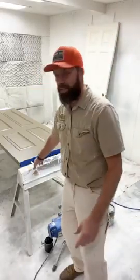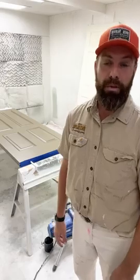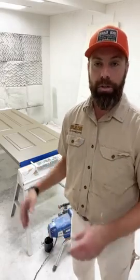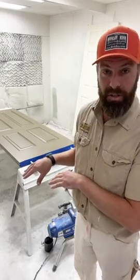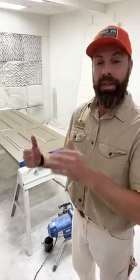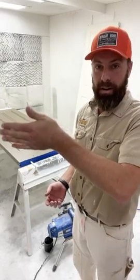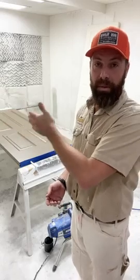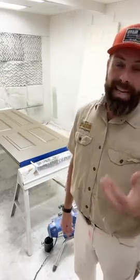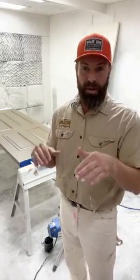A couple of these things, you can get a 4 or 6 pack for $10 to $20, and we peg the doors like that. And what we do is lay them flat here. This allows the door to float, so the door's not actually touching the sawhorse. We can spray all the sides, and then we create a system with more sawhorses where we actually stand them straight up and down like this on their sides, and we basically just line them up in sawhorses. Downside of that is you always need 2 people, and it gets weird when you're trying to move the peg doors around and things like that.